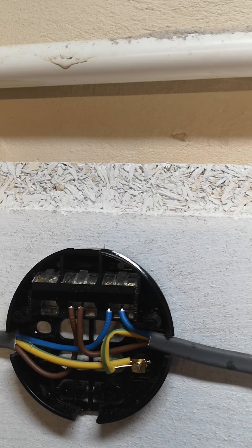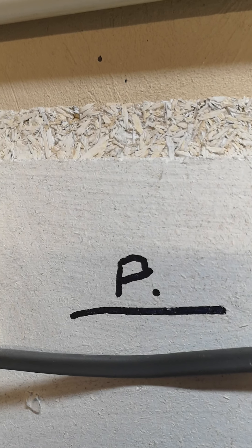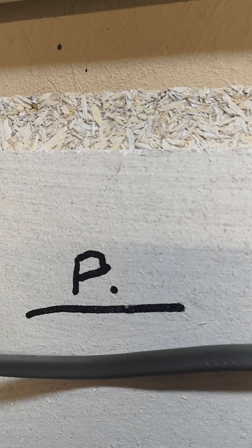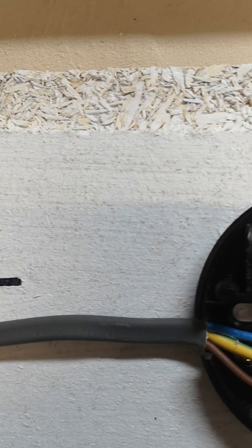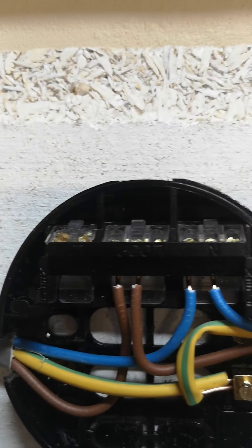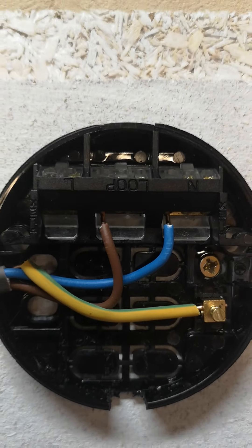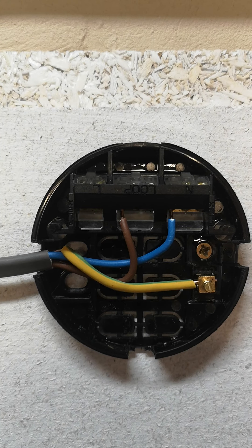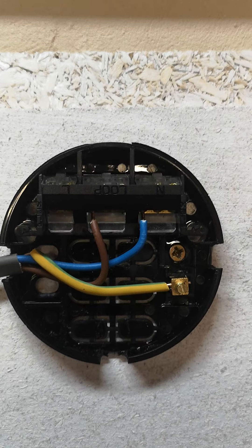So if I show you — that's the cable from the first rose. That's the cable there, P for power, from the consumer unit — or from the last ceiling rose. In this case it's from the consumer unit. So there we are, you've got a cable coming in: live, neutral, earth. If you're in the house you run the cable to the next ceiling rose and you've got live and neutral. So that's the end of part two.